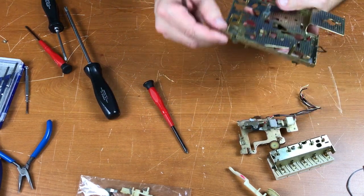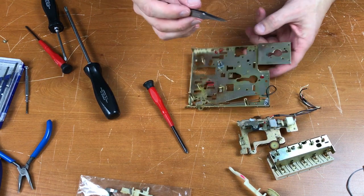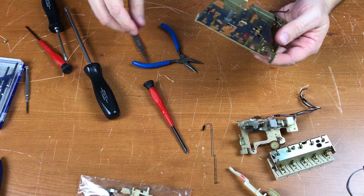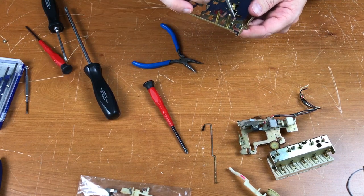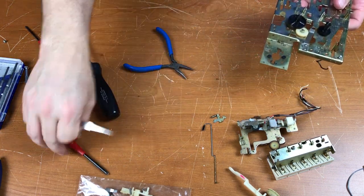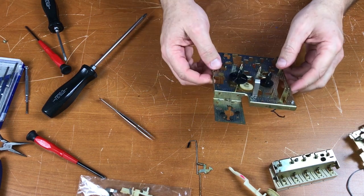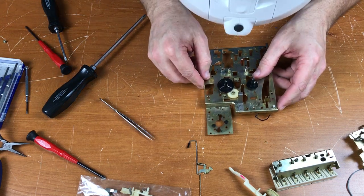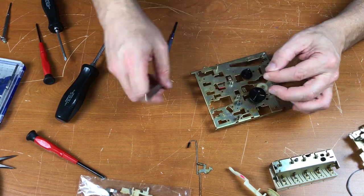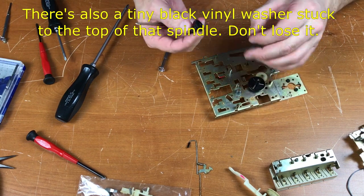This record protect assembly — I'm not sure it's going to come off easily. There's some old grease in here that's just dried up and gumming up the works that needs to get cleaned out. There's the record notch sensor. The spring here is loose already so this should just rotate off. Now the delicate parts: take-up reel, the supply reel, and a gear — these are held on with E-clips. Careful not to lose those E-clips. There's a spring under there.